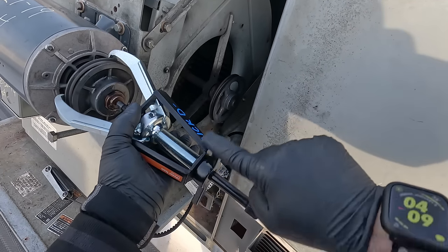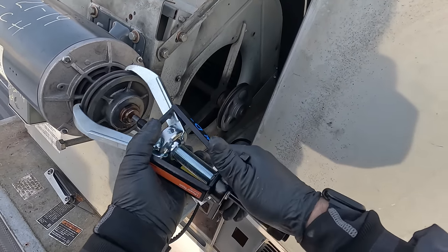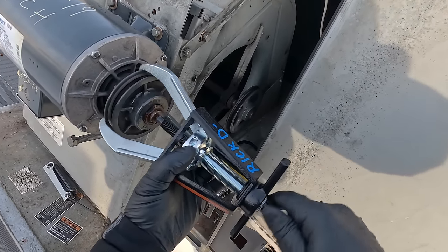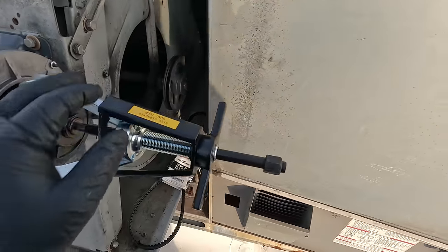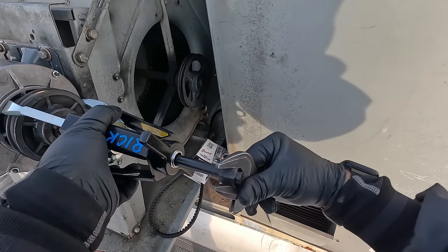There we go — just like that. It's tight, ain't going nowhere. When you've got a big pulley, these little ones ain't a big deal, but you get a big pulley and it's a major pain. There we go. Everything tightened up. We said the 208-volt amperage is 6.2; it's 6.2 on both of them, which is very unusual — whether it's 208 or 230.